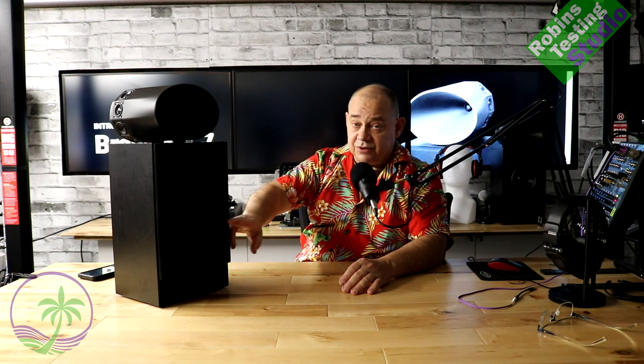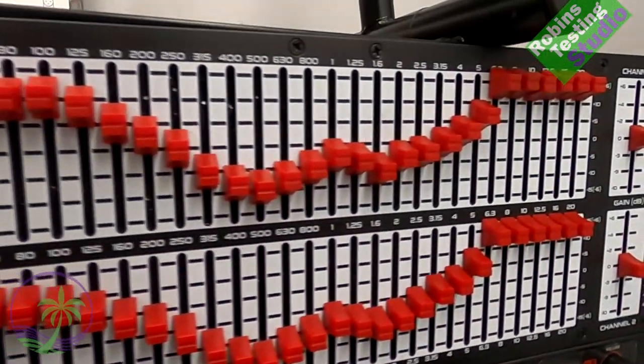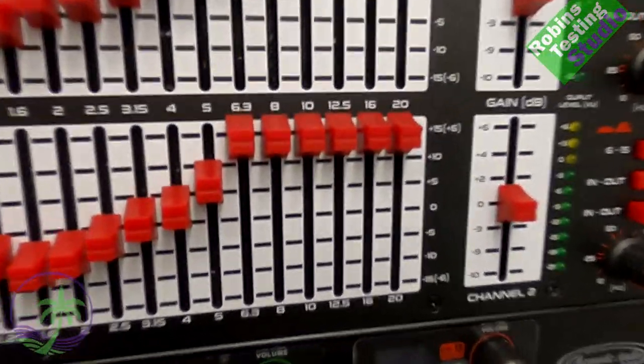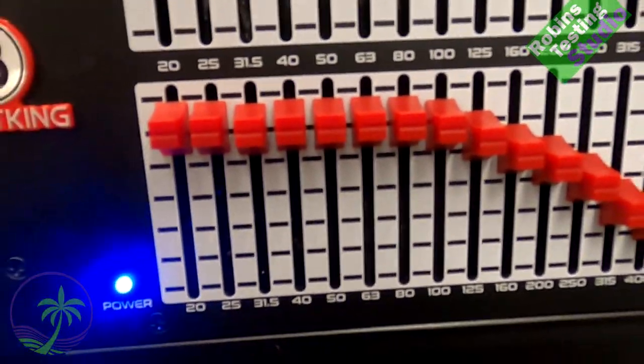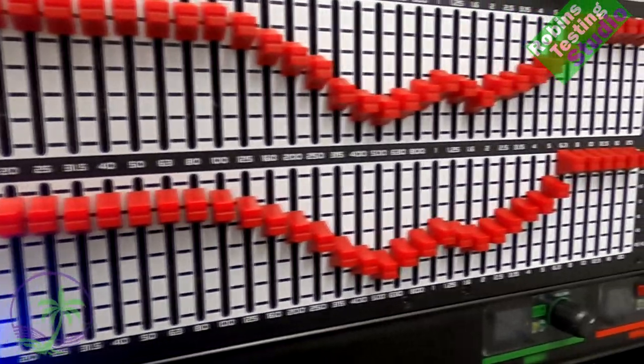Originally I had a spread of 25 dB between the mids and the highs; after adjustment it's about 17.5 to 20 dB. I wanted the bass to be more predominant — it's a mid-bass driver with a passive radiator on the backside and it's seven inches, so you have to respect that. Taking all that into consideration, I applied about a 20 dB increase in the low end. So from the mid-range to the actual low end, a 20 dB adjustment. With those nine mid-range drivers doing the heavy lifting, I can still hear distinct lows and highs without the mids swallowing everything.